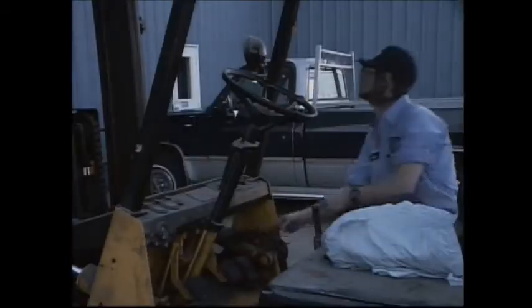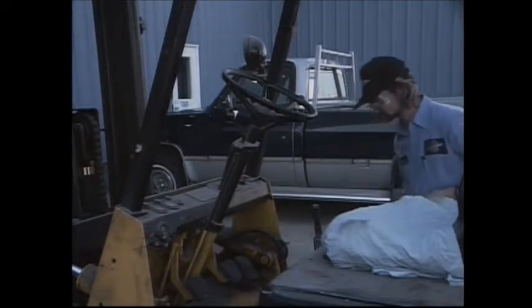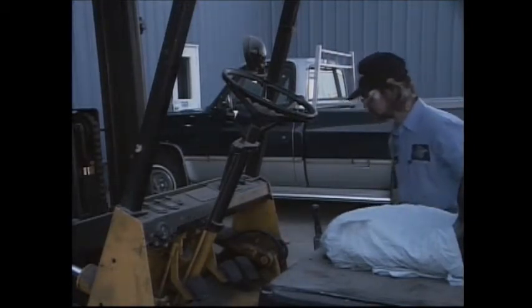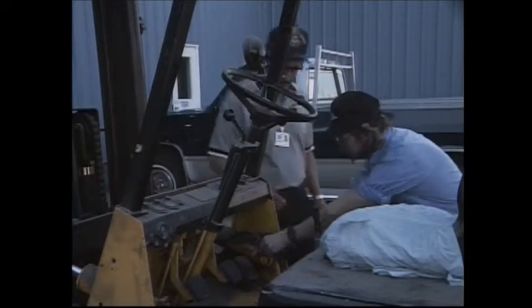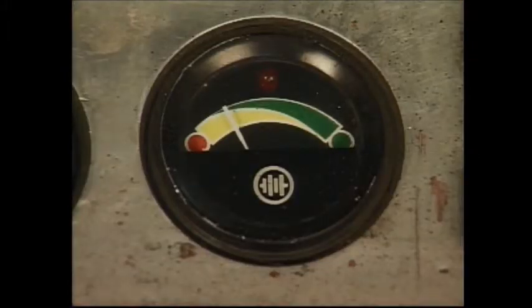If there are leaks in the fuel, oil, hydraulic, or transmission, it may be unsafe to operate. When you spot a leak, that's the time to notify your supervisor to have it checked by a mechanic. Naturally, always check your oil, water, and battery for proper fluid levels. Check hydraulic and transmission fluid levels. If you're operating an electric-powered forklift, make sure the battery is sufficiently charged before operating.